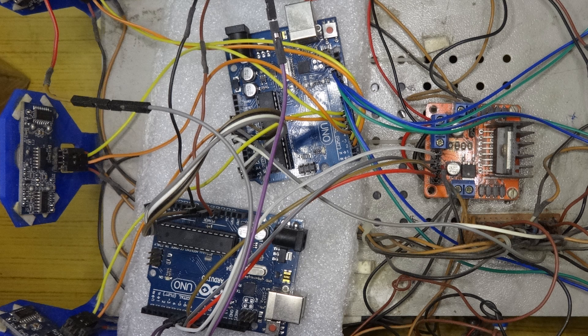The second and most relevant reason is that I am using six ultrasonic sensors. If you have played with these, you would know that they cause a considerable delay in the loop and can only be executed in sequential order if arranged in close proximity to each other. Hence, I am using the top Arduino to get data from the sensors and send it to the lower one via the I2C bus, and the lower one controls the rover with the data it receives.